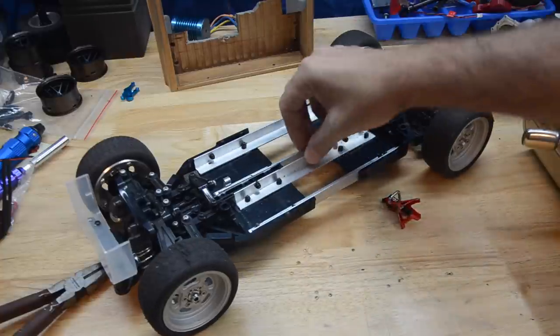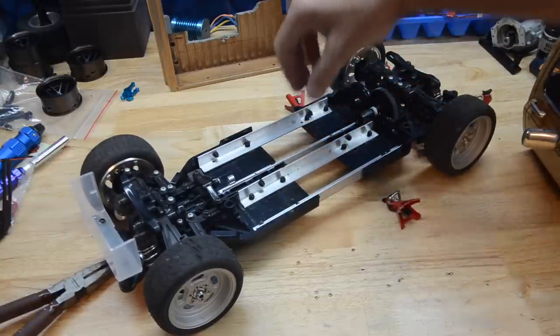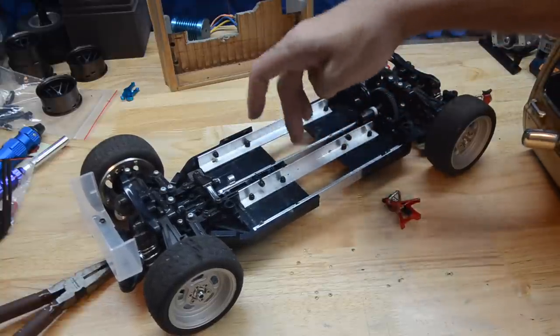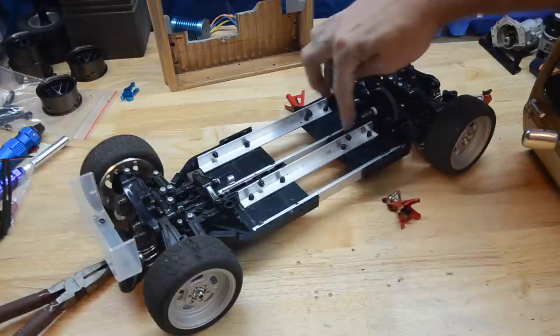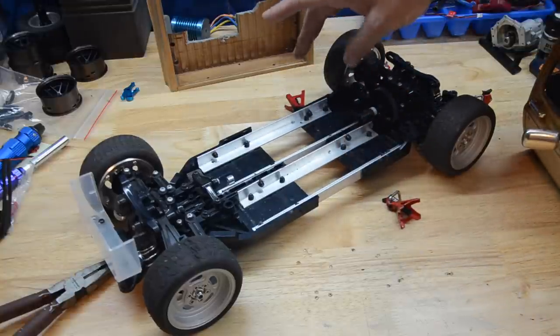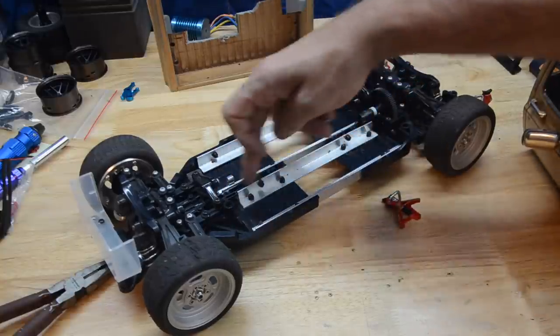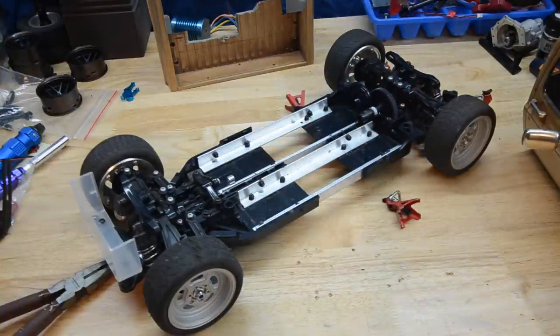So, this is pretty thin. This is 1/8 inch aluminum angle. And everywhere there was a corner, I stuck a piece in. I bolted these through the middle, through the chassis. So it should be as rigid as it was to start with, if not better. Got a couple in the floor, a couple through the sides. Just keep everything jiving and square.